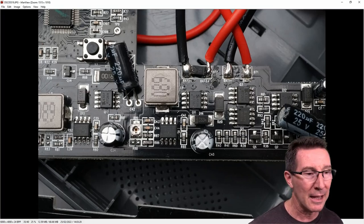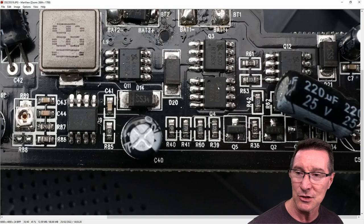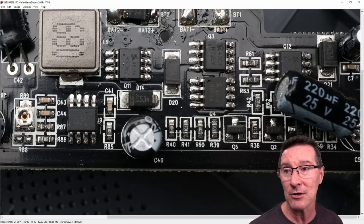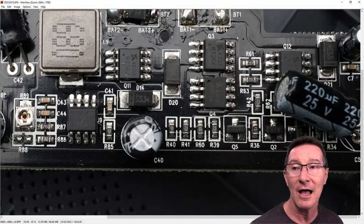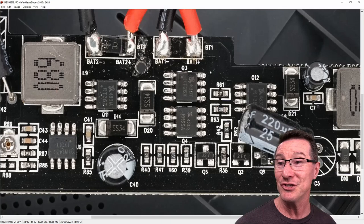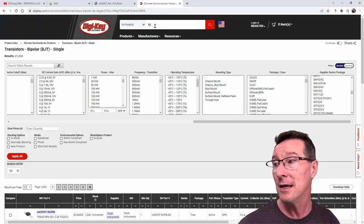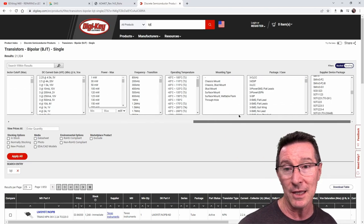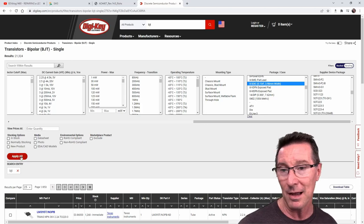There's another way to tell — get it at the right angle. You can see there's a huge track here; three pins are actually shorted, and all four pins on this side are shorted. This is a classic pinout for a MOSFET in an SO8 package. Generally you won't get a BJT transistor in an SO8 package. If we search DigiKey for BJT, single, and filter by 8-pin SOIC package — basically one result, zero stock, and it's obsolete.